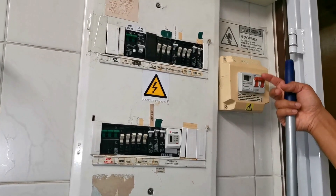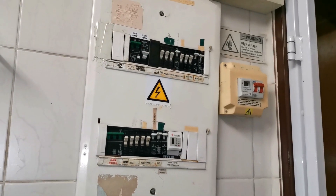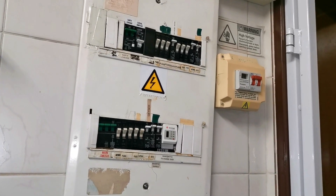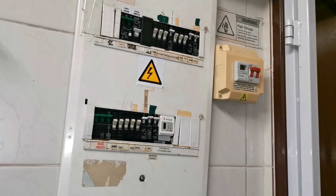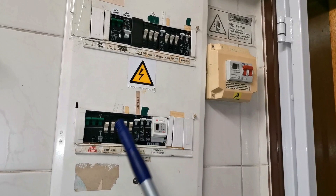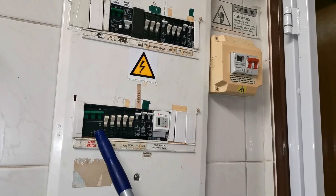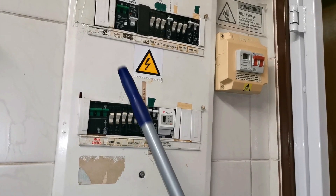To replace that exploded CBI - semite meaning the way it fits onto your DB, you have semite and you have DIN rail mount - a semite CBI earth leakage costed about 1,200 rand at that time. So I said no, I'm not going to spend 1,200 rand, let's just make it single-phase.